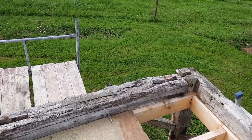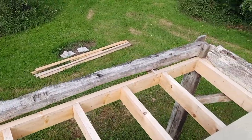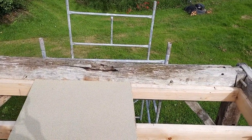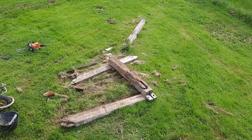The main objective with this project was to keep it standing, and hopefully it'll carry on standing for another hundred years. The main centre post I'm using this end would have originally been the centre main post — there were three bays, but I've reduced mine down to two because there's quite a bit of rot. The only upright I could save was the middle section, so I'm about to find out whether I can adapt it to go on the end. I'm putting it into position now to see how I can adjust and make it fit.